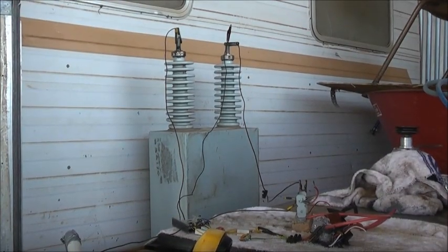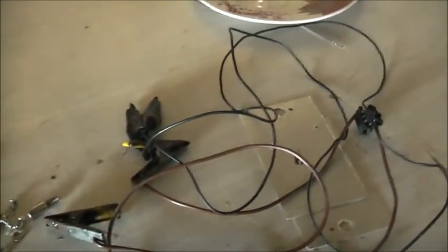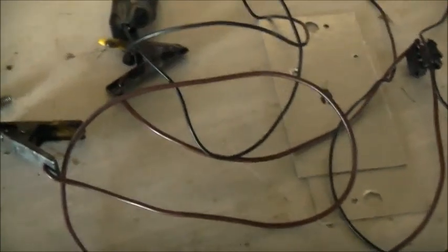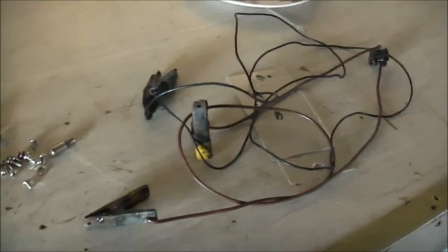I can jump on the high voltage cap bandwagon and have some fun, but I'll have to make up a good secure setup - a little chamber to pop things in with a good safety barrier in place. Once this thing fully charges up, I reckon I could vaporize some components really well. My piss-weak wiring is only capable of about 10 amps, not giving me a very good result. I need something much thicker with a bit of extra high voltage insulation - it will help deliver the current better. Then I'm going to start getting some big bangs. I'm going to have to design the shorting strap system and run thick connect wires. I'm losing a lot of power through this wiring. Anyway, that'll be enough for now. Thanks for watching.